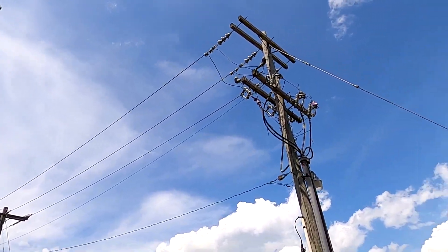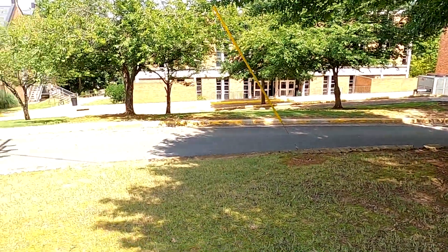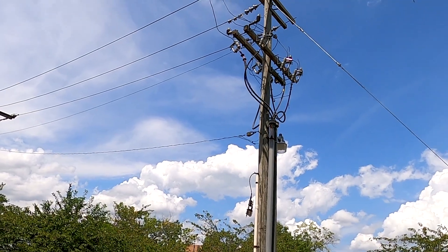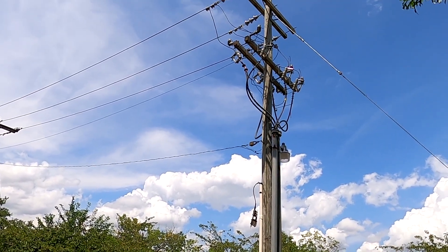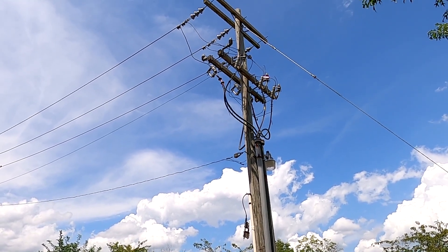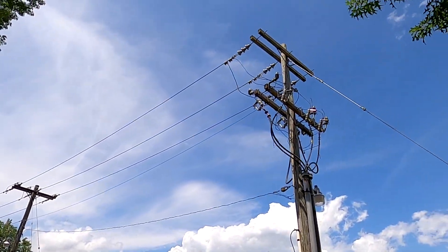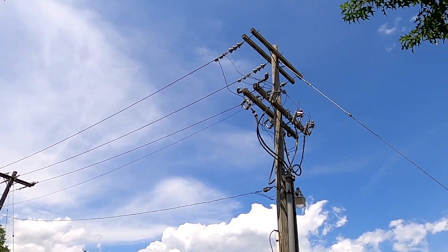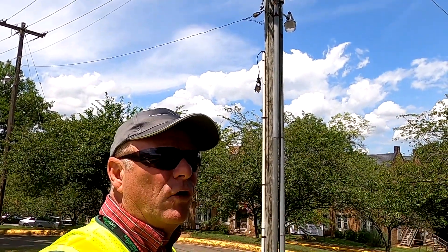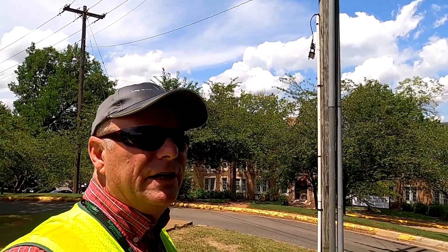What's most interesting is look at how small that wire is — it comes in and feeds through the fuse gates and feeds that bigger wire. It's just a lot smaller wire. I'm not sure what voltage is on the high voltage side — maybe 7,500 volts, maybe somebody can tell me. It feeds down to transformers in the different buildings. You can see that bigger wire and then that little dinky wire — I don't know, maybe a number four — comes down into those gates. That shows you what higher voltage does; you can use Ohm's law to check what voltage and wire size you need.